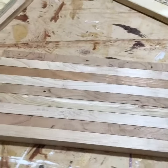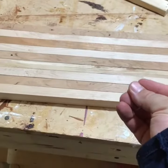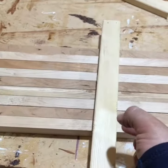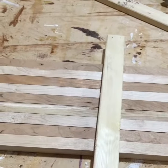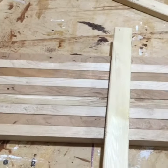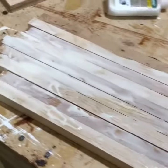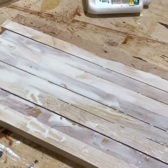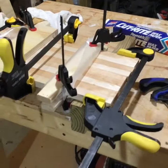I'm going to put them together and then clamp them together. I'm also going to clamp from the top and I'm gonna use the wax paper so that when I put this on and clamp, the wood doesn't stick to the other wood. This is all glued up — I've got to do this quickly because it dries pretty fast. I'm gonna turn them all and put them together. There we are, all clamped up.